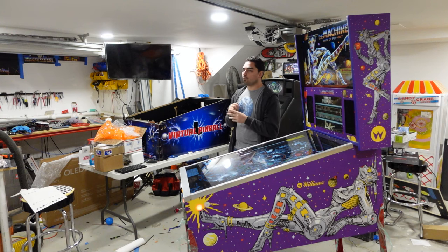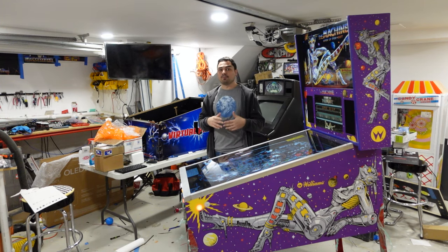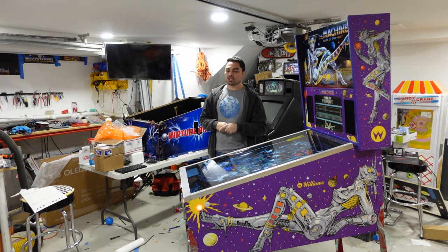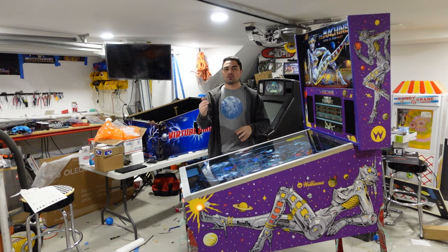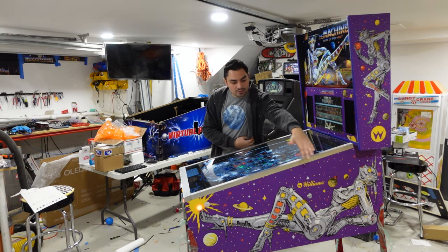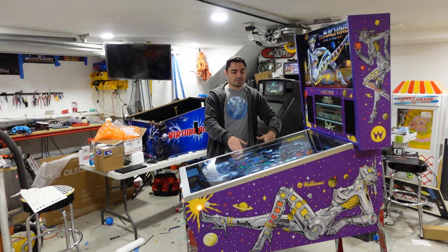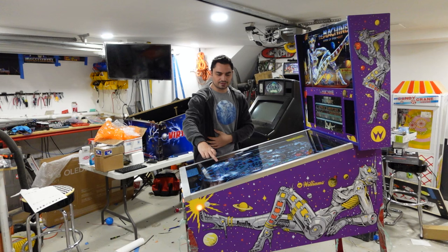But, you know, watching, and it's funny, we talk about Mr. JNet. If you don't know who Mr. JNet is, he's got a Bible. We call it the Bible, the Bible on how to build a virtual pinball machine. You could go look at the Bible. He's got kind of a way that the solenoids should be set out. I followed his guide. What am I getting at? I have three solenoids here, three solenoids here, and then you have the three in the middle. I actually have two in the center for the slingshot.